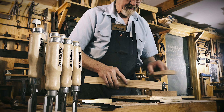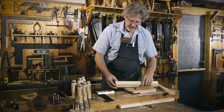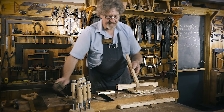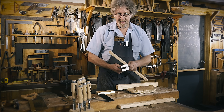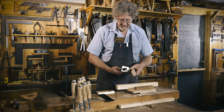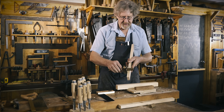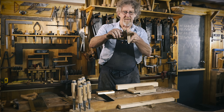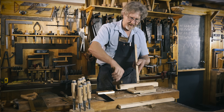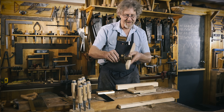That's pretty good. That's defined the two sides where my piece of timber is going to go. The next thing to do is to find the depth down in here. What's the thickness? I don't even have to give it a number. I can pick up my marking gauge and find that spot — I'm looking for where the point gets right onto that edge. I think to remember: it's easy to take wood off; it's very hard to put it back on again.